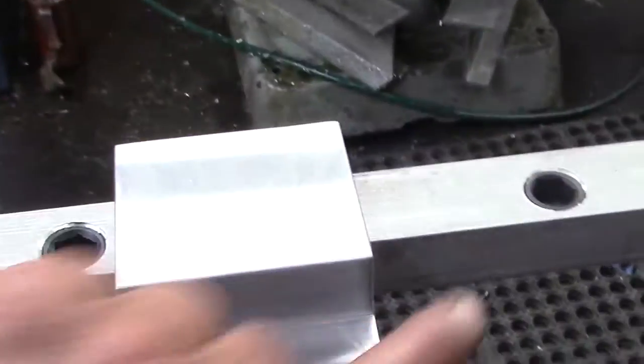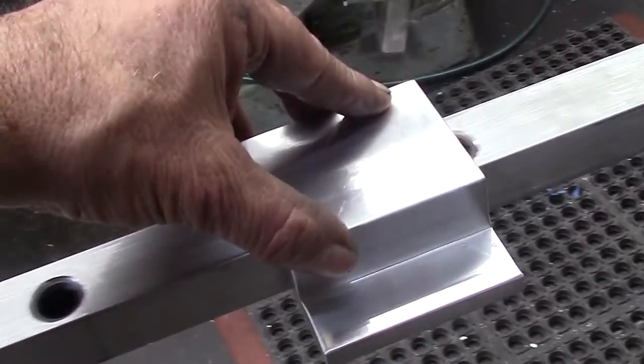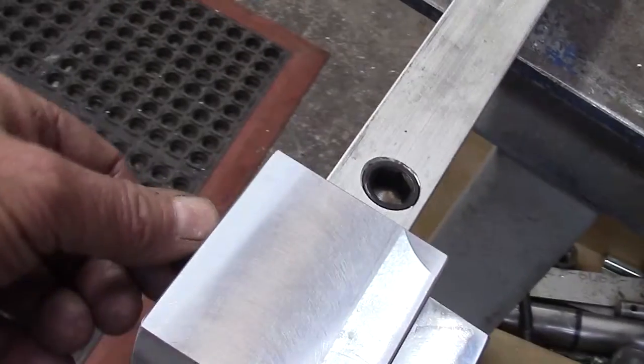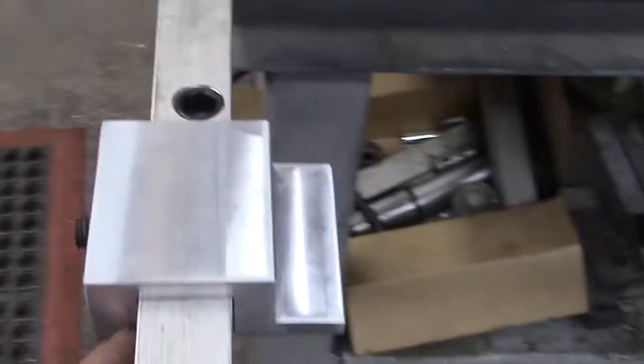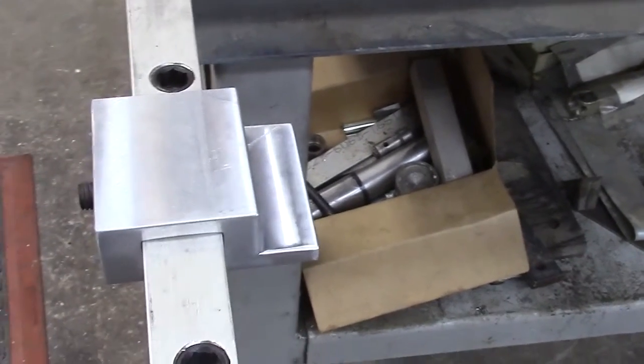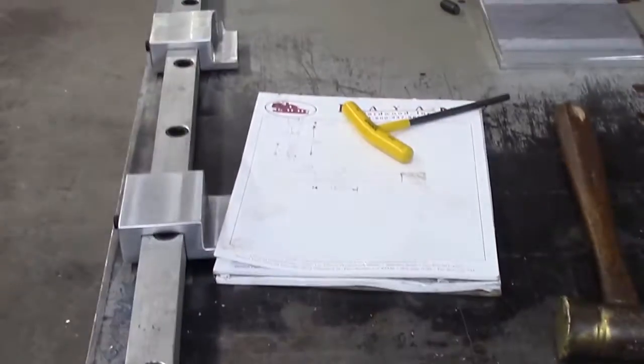On the sides of the jig, right along the side, will be a measure, so we can adjust these to wherever we want to get the distance we want, and the little set screw will tighten it on so that we can use it without this moving and changing the cutout on the pin router. So we've just about got this complete.